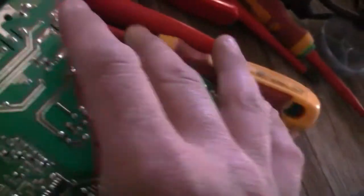There we go, let's get these capacitors changed out. Okay, viewers, that's all the capacitors taken out. All cheap brand capacitors, because they are crap. Even that one there was bad, the main filter, 400 volt. I got another one in there. All recapped, this thing should work nicely now. Let's test those bad ones.